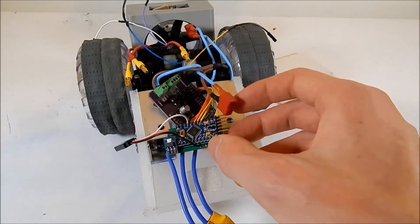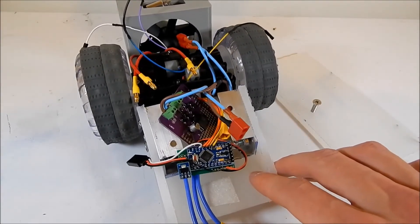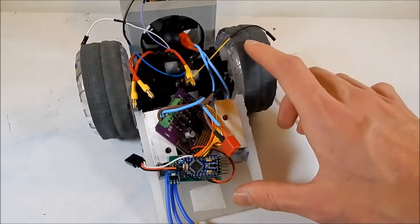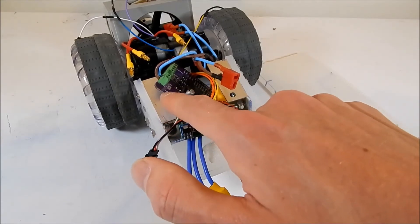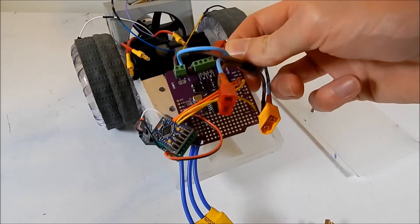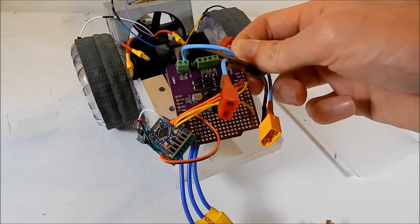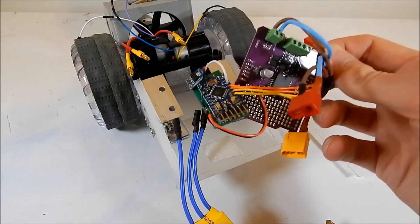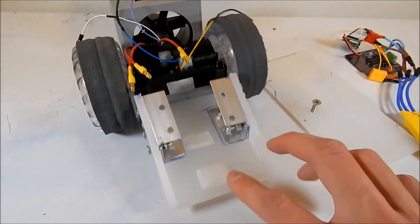Lots and lots of stuff to be learned from this little experiment. Things fail all the time when you build stuff — that's just part of engineering and the engineering process. What you then do is learn from those mistakes and go again. So this whole thing is actually going to be rebuilt now. I need more space for all my electronics. I think we're going to discard this 2 amp speed controller because it's just too big. I'll do some testing on these motors and see if I can run them on 1.2 amps — I probably can — so we can shrink the board down significantly.